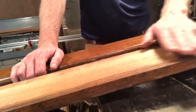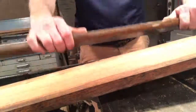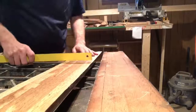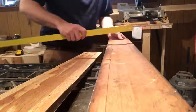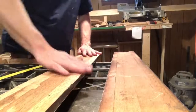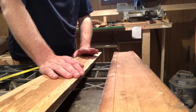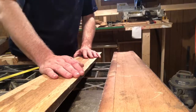Just to save time, we'll use the power planer to knock down the two high edges first, running it stain-side down. The hand plane approach is a little more work but it's much quieter and less messy — it still makes chips but not all the dust the power planer makes. We'll finish one piece up with the hand plane and then run it through the power planer to get it down to finished thickness.